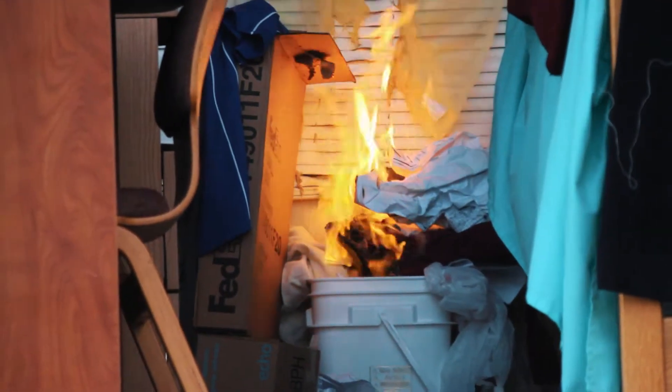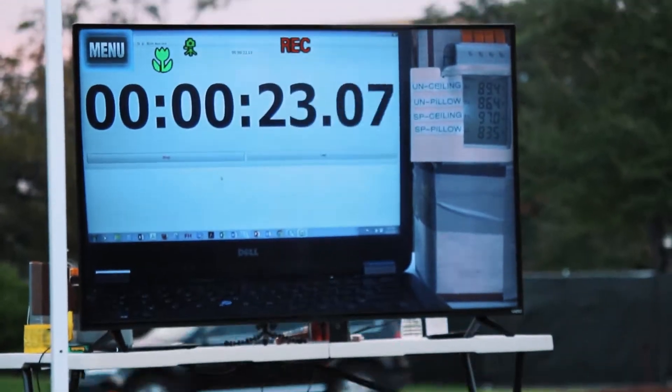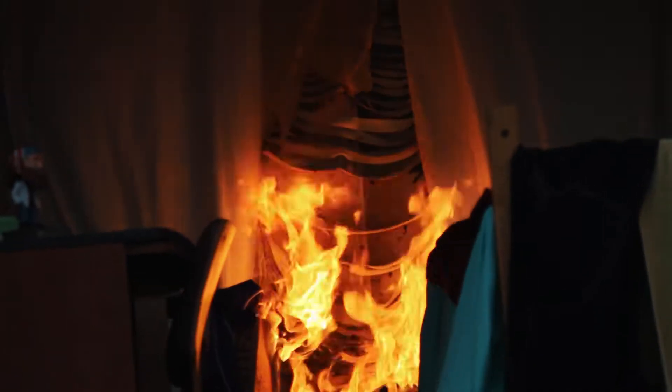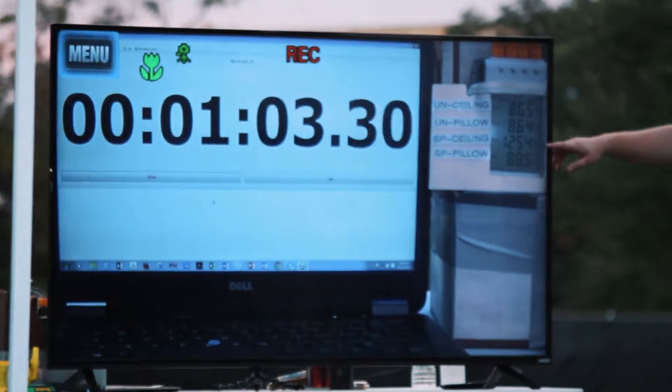Let's see what the timing is and what the temperature gets to on the ceiling over here. Most residential sprinkler systems, if it has the little red glass thing in it, it's going to go off at about 135 degrees. It's at 117 on the ceiling now... 130 — it's coming up pretty quick. And there it went. So at 54 seconds, the sprinkler has it knocked down so you can escape. You can actually still be in your bed and this thing would go off and wake you up — you're going to get really wet if you hang out in there.